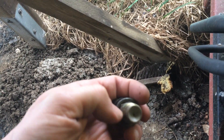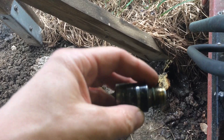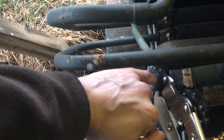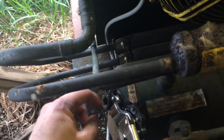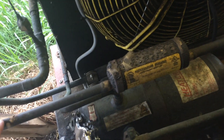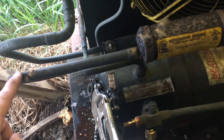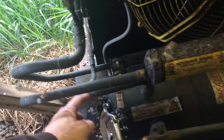Normally it pushes the whole lot out, so it must be hollow inside. When you look at how thin that brass is — when it's full of solder it's got quite a bit of strength to it, but once they've gone hollow it fails. Anyway, we'll get the old sealant cleaned out of there, get a new plug in, put some nitrogen in. I don't think we've got enough 407F to do this job today, so it might have to wait until Monday unless we've got some in the stores. I expect this system holds around 6 or 7 kilos and I've probably only got about 1 or 2, but we can get the plug changed, put some nitrogen in, and then when we come back we'll know we haven't got any other leaks.